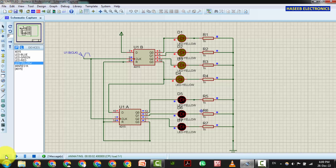In this situation we can remove the last LED so it will work this way. Pin number 7 connects to positive, pins 9 and 1 connect to the clock signal — either manual or automatic. Pins 6 and 14 connect together, and we connect to pin number 2. At any output stage we can make a reset: if we loop pin 10 back to pin 6, this IC will light only three LEDs — at pin 10 the fourth output causes a reset, so those three LEDs cycle.